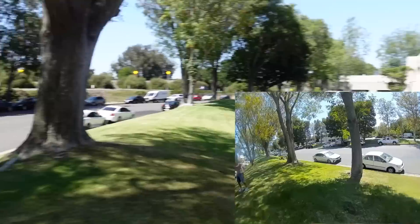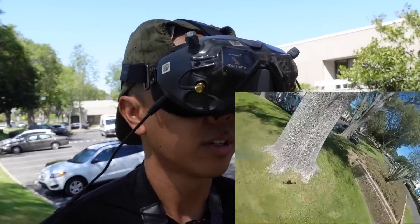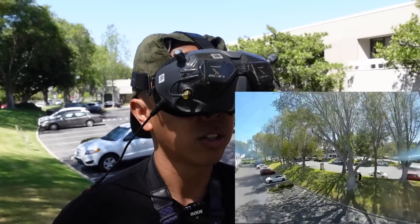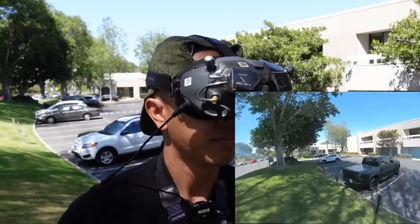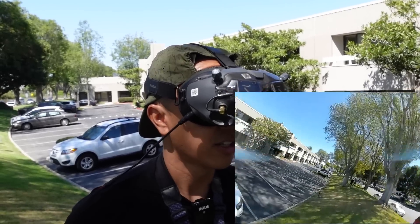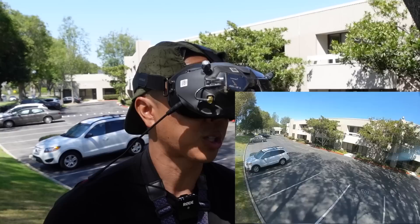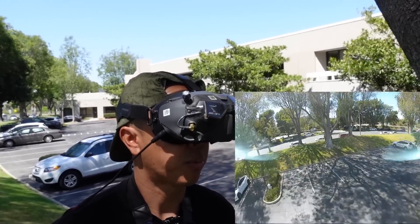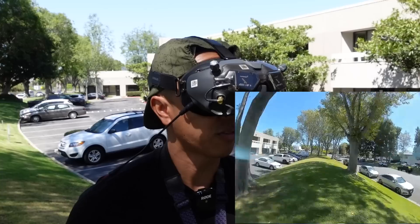She's definitely smooth — I don't hear anything weird. Let's get some black box data, let's get a couple of punches. My initial testing is that this feels great, I don't hear anything weird. I'm getting a little bit of prop wash, but this is also not tuned — stock filters on 4.3. The only thing I did was enable RPM filtering and flash BLHeli_M as I said earlier.